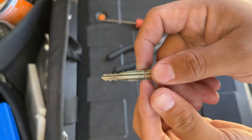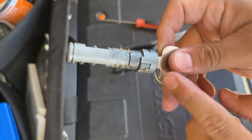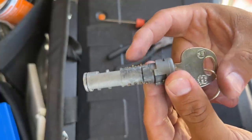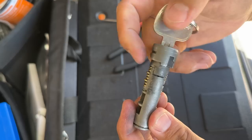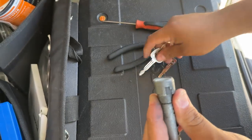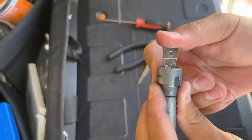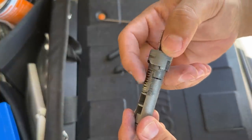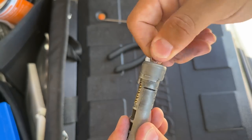Here's our new freshly cut blade. With the old key in the lock cylinder, you can see the third wafer and sixth wafer are sticking up — they're not flush — so this key will not turn the lock anymore. Now I pull the old key out and stick our new freshly cut key in. Look at that — all the wafers are nice and flush. That's what we want to see. We now have a completely different key.